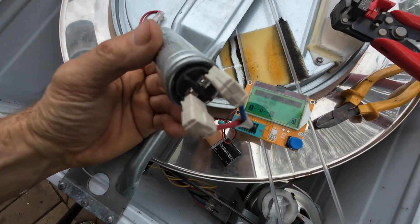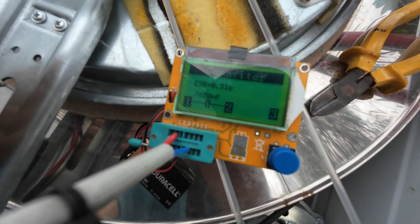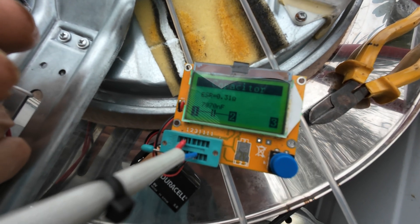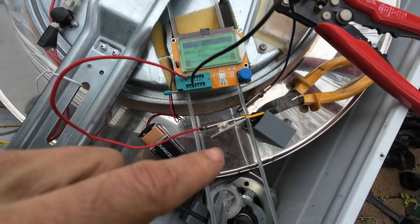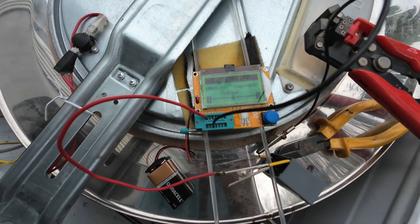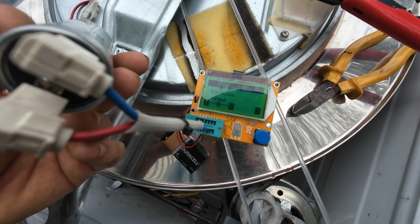I've just tested this new one - it should be testing at eight microfarads, and you can see that it reads 7870 nanofarads, which is basically 7.8 microfarads. This one is bang on spec. And the old one is testing at 1024 nanofarads, which is one microfarad - that's a fifth of what it should be. Definitely stuffed, definitely going in the bin.